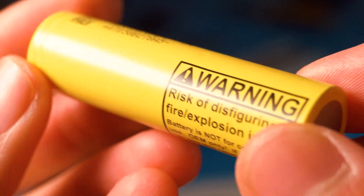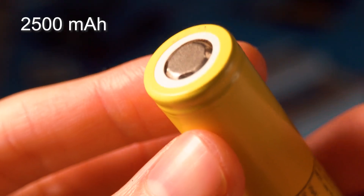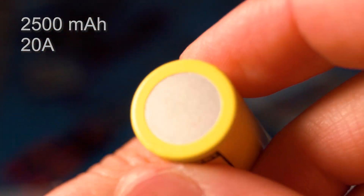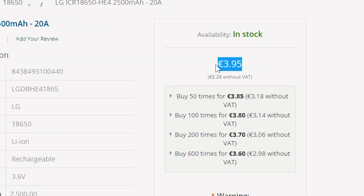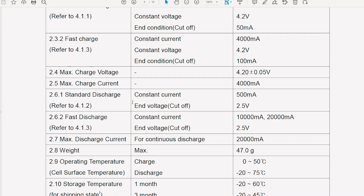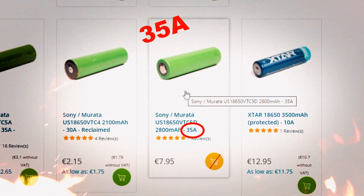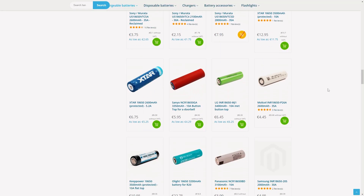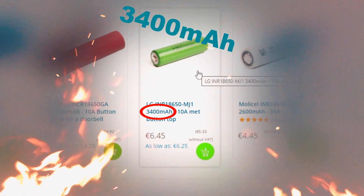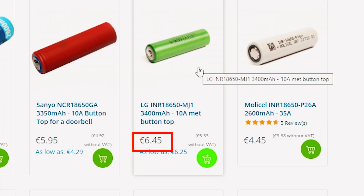I'm going to start making my first battery pack using lithium 18650 cells. Specifically, I'm using LG cells — each one has a capacity of 2500 milliamp hours and you can discharge them at 20 amps. There are other options: the Sony Murata can hold 2800 milliamp hours and you can draw up to 35 amps, or if you want more energy storage, there's one with 3400 milliamp hours capacity, though it costs a little more.